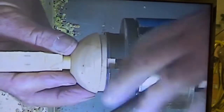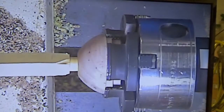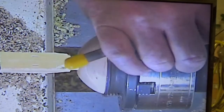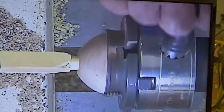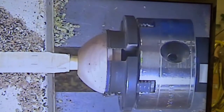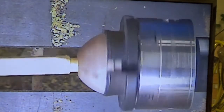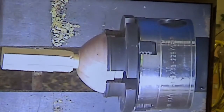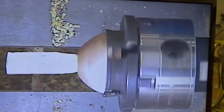Okay, I'm going to put it on the eccentric, the off-center tenon first. And I'm going to make 2 cuts that I had to practice, and I think we all practiced in the very beginning of woodturning. That is coves and beads and coves. I'm going to turn half a cove and then half a bead on this finial. I'm going to tap that in till it shoulders out on that flat spot. With that shoulder, we have support for our cut.